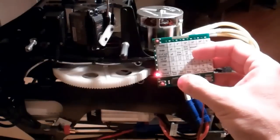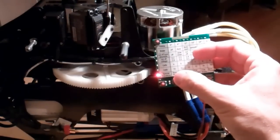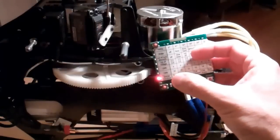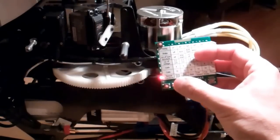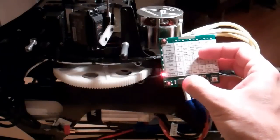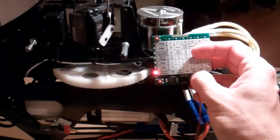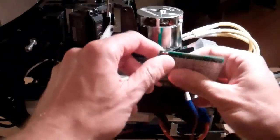And you also need to be very careful about having your blades off or your motor disconnected, removed from the pinion and so forth, because it can spool up on you and be real nasty. So just make sure that you have these safety precautions set up and that you do go through the Vbar to set up your stop and full speed. I found that to be very important.